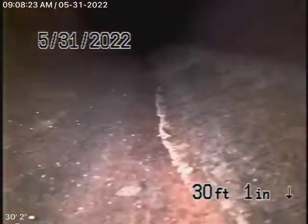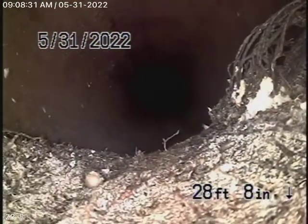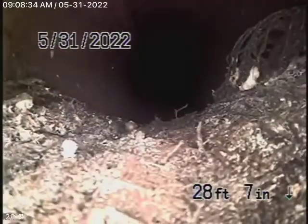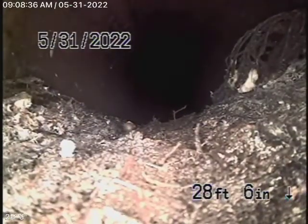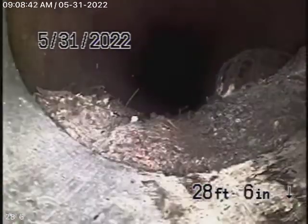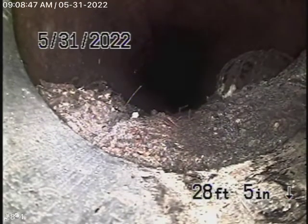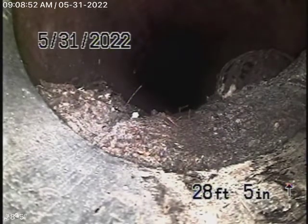When you come back to this spot right at the beginning of the lining, there are roots getting in. Linings are basically a temporary fix, especially when heavy roots are present — they don't really stop the roots from growing. This is the connection between the lining and the ABS plastic pipe, so it's difficult to say if the roots are coming through the coupling band they used or through the lining itself.